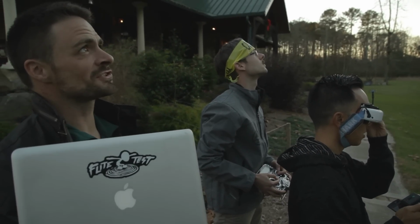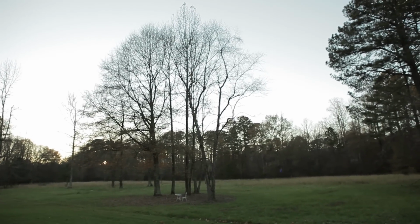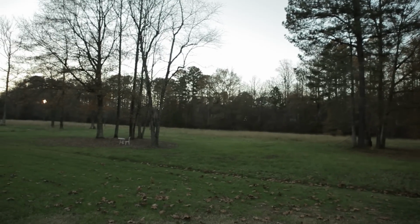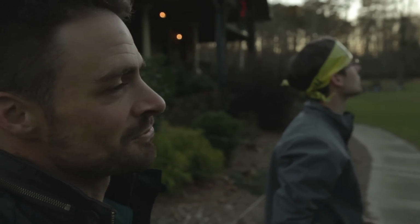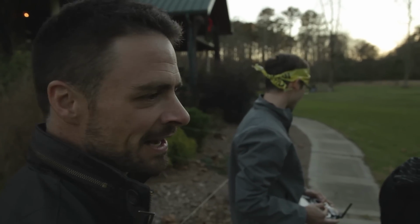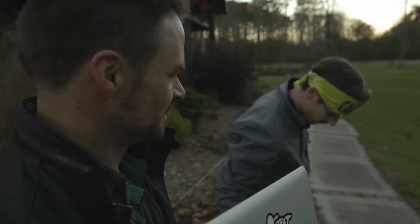So essentially what Steele's doing at the moment is he's giving really quick control movements in roll and pitch on low throttle and seeing what's happening there. So that's where you're going to start tuning. We're seeing how it's reacting. I think it's got too much D and the speed's not high enough. So how well it reacts to your input and how fast and clean it stops afterwards. You could bump up P more.